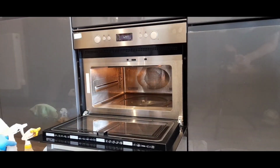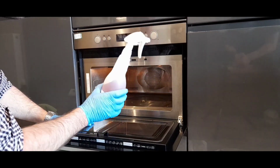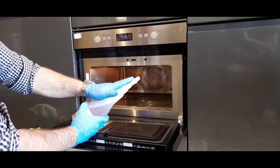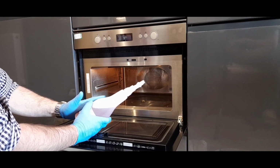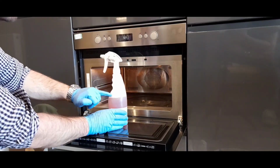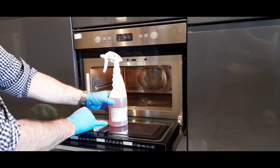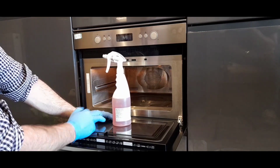The chemical, again, is quite harsh. You don't really want to breathe it in. So I'm going to leave the link in the description below for the degreaser. This is a very good chemical. You don't need a great deal of the neat mixture. You need about 3 pumps out of a 5 litre tub into the rest part water. You top up the water to the line, so you end up with a little bit of degreaser in the bottom, and the rest gets topped up to this line with water.